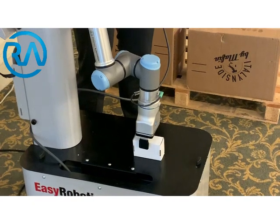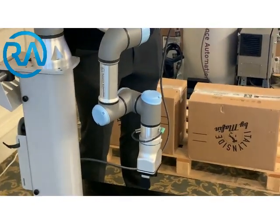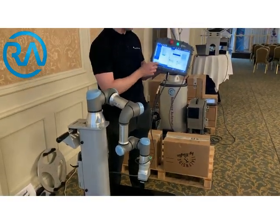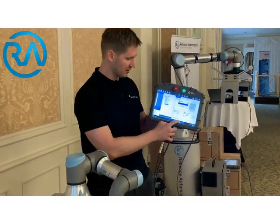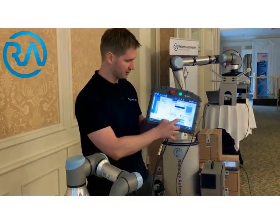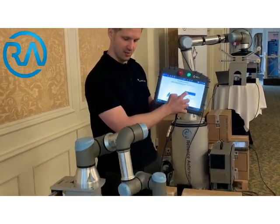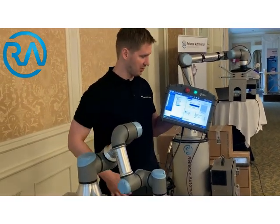And one more move command so it just clears. So for this program, I've got about ten commands — very simple. Just going to position, position, close gripper, open gripper, and a wait command. If I just press the play button and follow through where it takes you and start the program off, we're going to repeat that program.